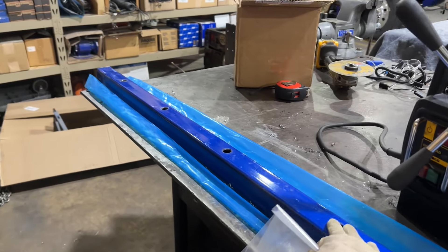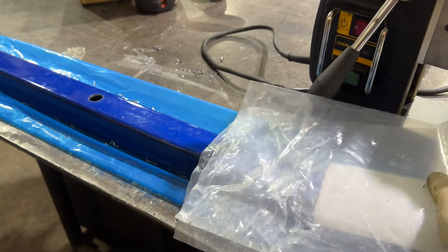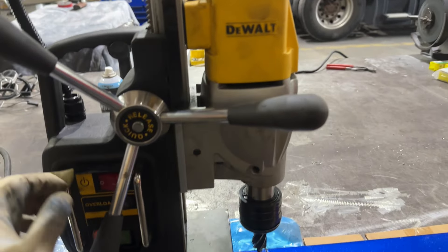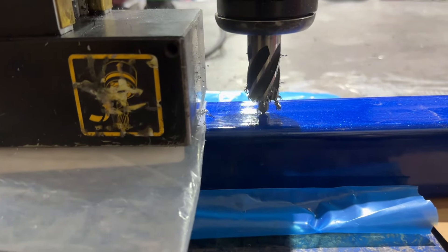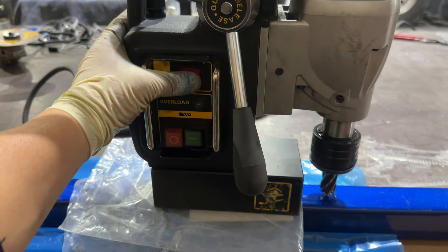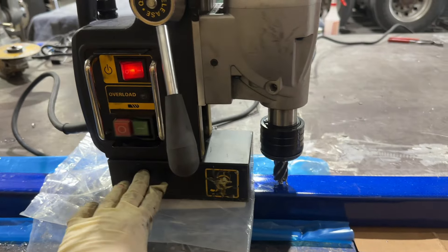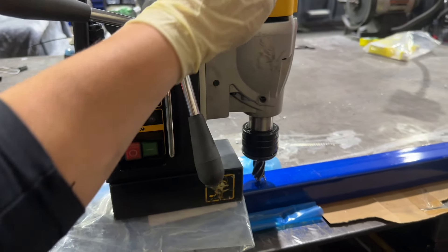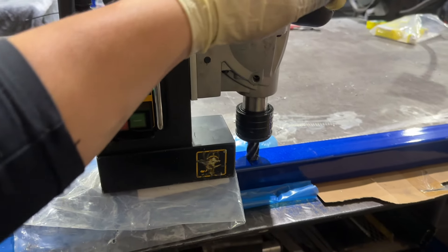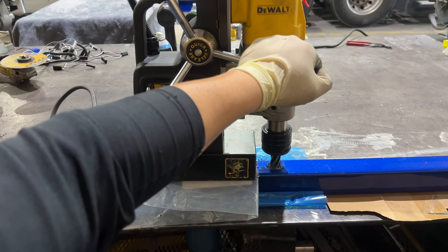I'm currently drilling holes on this pole here from the other side. Let me show you how this machine works. We're going to lay this plastic bag down so that we don't scratch it, and I'm going to set this big machine down. You lower this drill bit down into the little spot that I marked on each section. This power button turns on this really strong magnet right here, and now you won't be able to move it at all — it's super strong. You just hit this power button, lower this down, and hold it down until it drills through, just like this. It's very easy — you can do it with one hand.